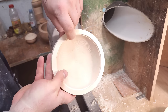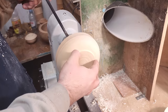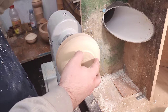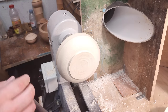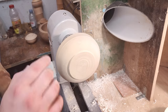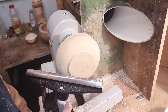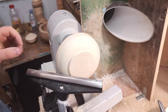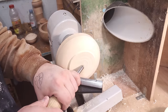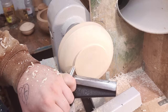The jaws will fit onto this lip — you just need light pressure to expand, and that's it. You can see how it went a little oval, so once I thin it down it will probably go even more. Sometimes you just cannot prevent wood from moving. With the spindle gouge I'll just true everything up.